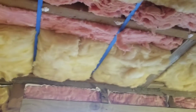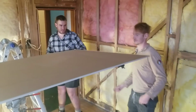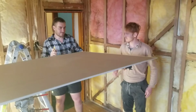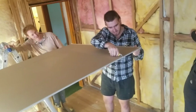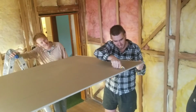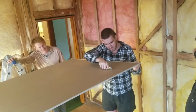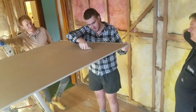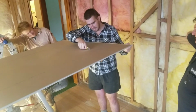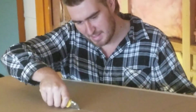Who's the cutter today? So we've got these dobs of glue, and we've done that while they're doing this free-handed, right? Roger. Turns out jib isn't too bad. Free-handed. So all the strength in jib is in the paper. As long as you cut through that paper, when you go to snap it, it goes okay. I'm cutting to the left of the line just so we can measure once, cut twice if we have to. See how builders work it.